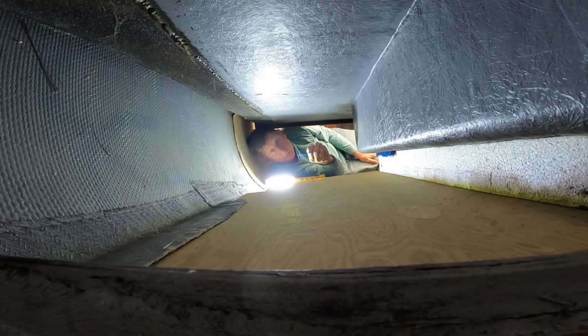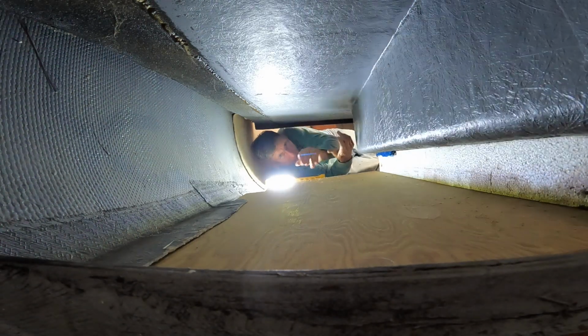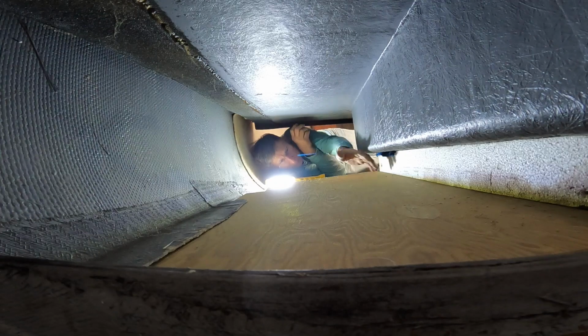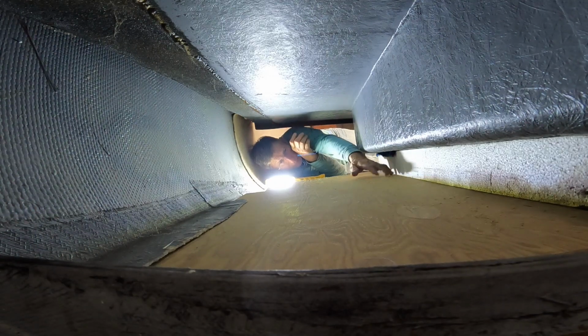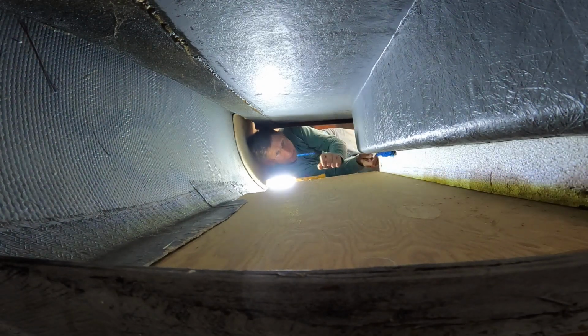I have to put a cleat on the bottom of this at the far end before I put it all the way in, so I've got to remember to do that. And I've got to drop in my reinforcing partners or sisters down this stringer over here. But I just wanted to make sure this was going to work first, and it looks like it is. Now I'm going to take this out and coat it with epoxy resin. I'll cut my strips and get all those coated too, for rebuilding that stringer.